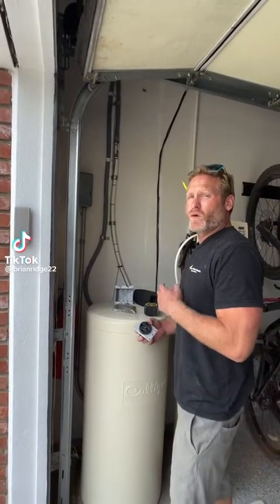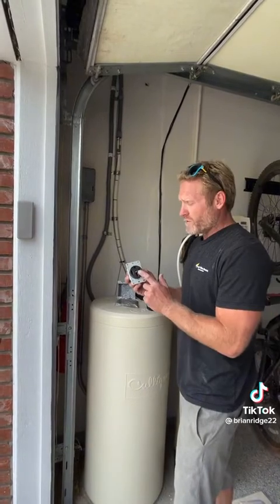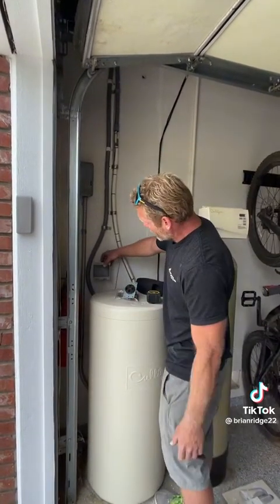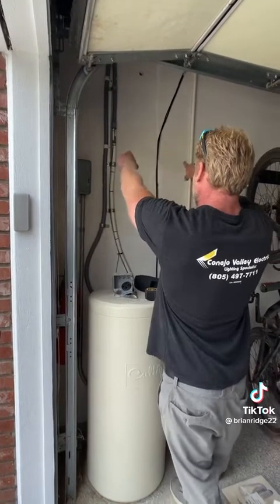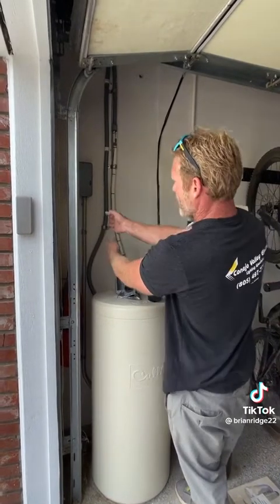This customer wants to install a 240-volt outlet in their garage to charge their Tesla from home. We're going to be installing a 50-amp NEMA 14-50. I'm going to be installing a two-gang box right here — my panel is on the other side of the wall right in this bay, so I'm going to keep my outlet to the bay to the left.